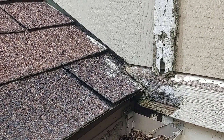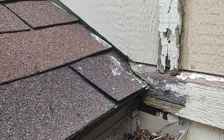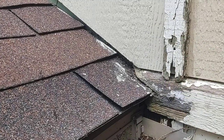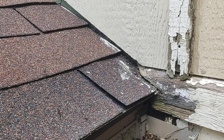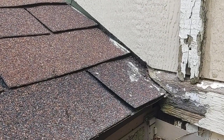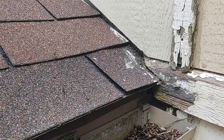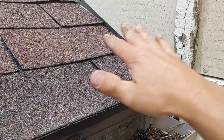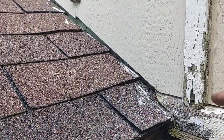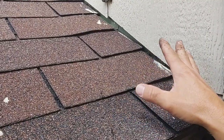Quick video on a how-to DIY — in this case a quick roof inspection. I came across something I want to show you that might give a little insight and info. A tip for somebody doing their roof on how not to overlook this — it's pretty important. It's called a kick-out. Different roof sections may tie into a wall differently, but this is where a shingle roof goes into a wall and the wall continues down. I'll show you why kick-outs are important. This wall has flashing — different types of flashing exist, but this one has step flashing.